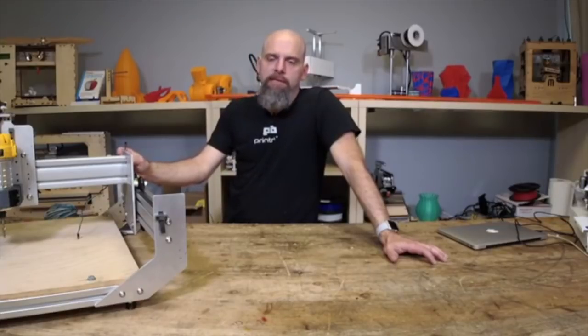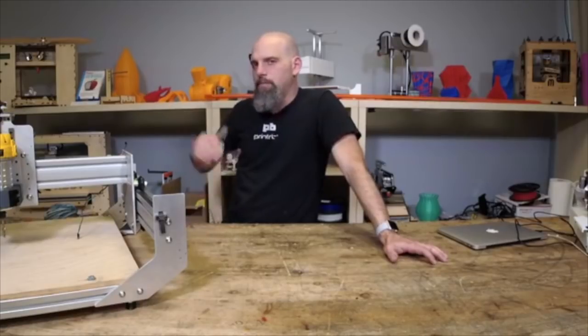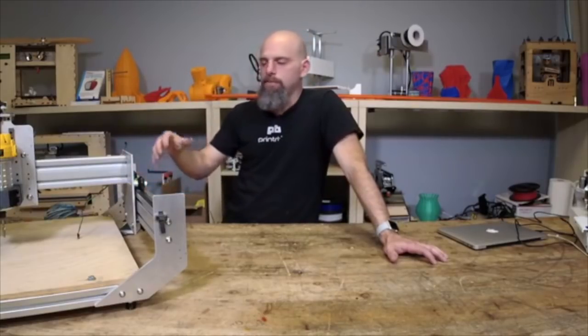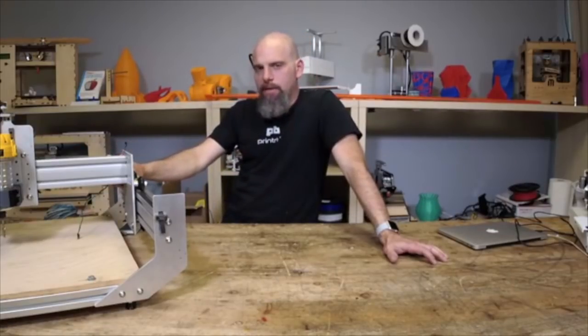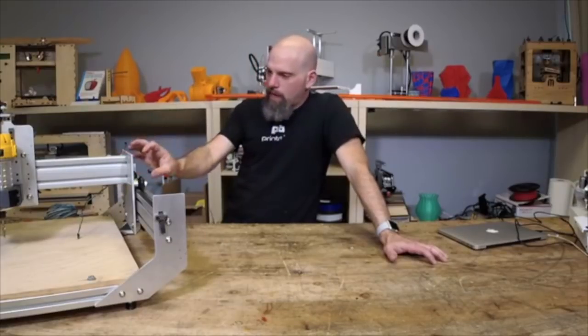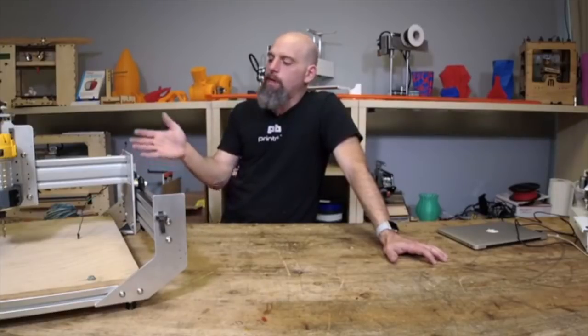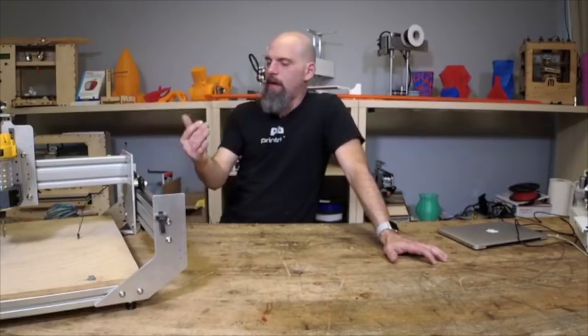It only makes sense in the Y, the long axis of, like, the Crawlbot, the long 8-foot section. And it gets pretty pricey to buy a whole bunch of rail to go that big and build a big table. So I think the more common use of this will be smaller machines than 4x8. So I thought, let's let go of the rack and pinion for now, because we know we can get access to this plate and put a hole in it if we need to. We know we can even replace it with a pinion system. So everything's cleared to add that pinion later, but my priority was, what's useful for small machines?